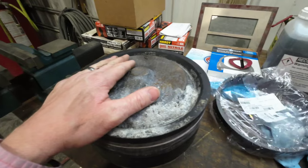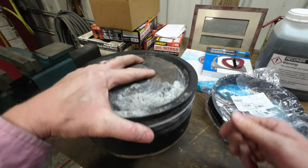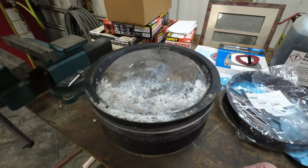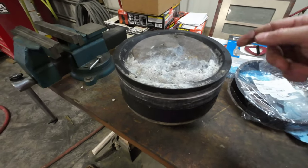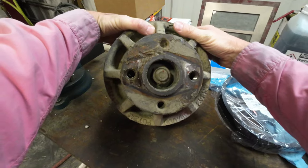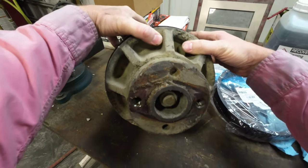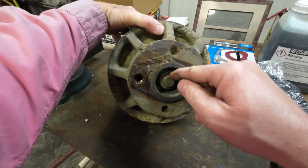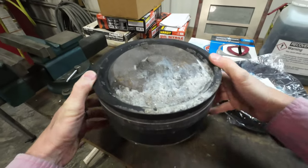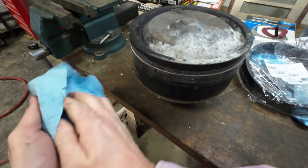This is a guide ring and the piston seal. I'm going to get this cleaned up. I'm going to take a 30-millimeter socket and zip this off, take these off — which sometimes can be fairly tight — and we're going to slip the new ones back on and bolt it together. Some people do replace the actual bolt going through, which is probably not a bad idea. We did on the last set we rebuilt, however on the 38 I used the old bolt. Sometimes I don't feel it's that crucial — we've never had problems — but a stretched bolt or a nut that doesn't thread tight could be an issue.